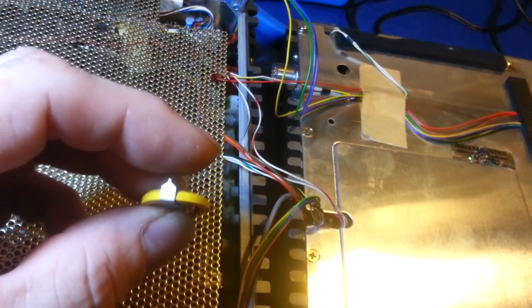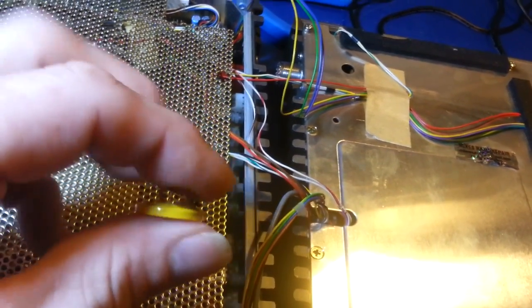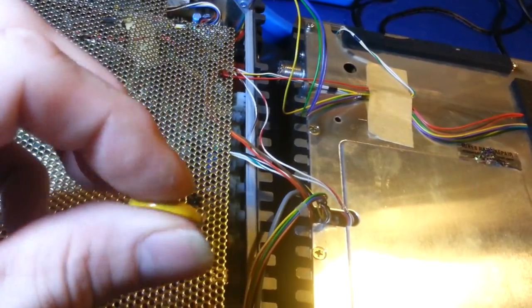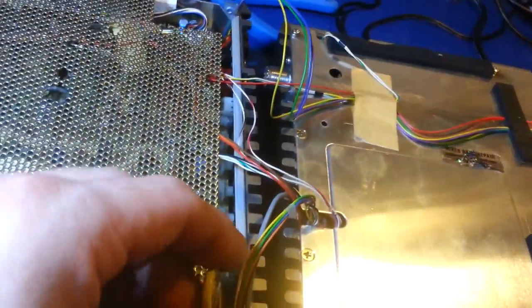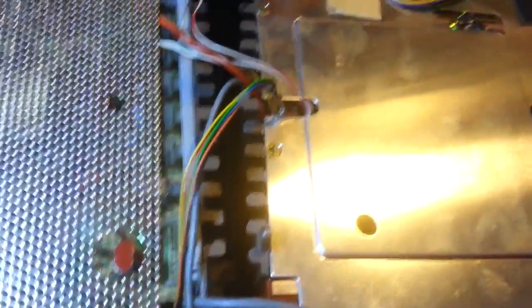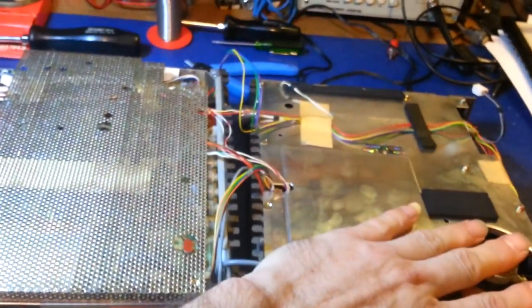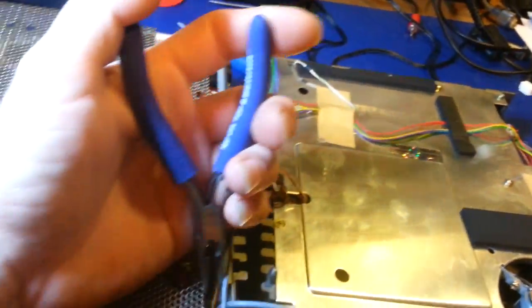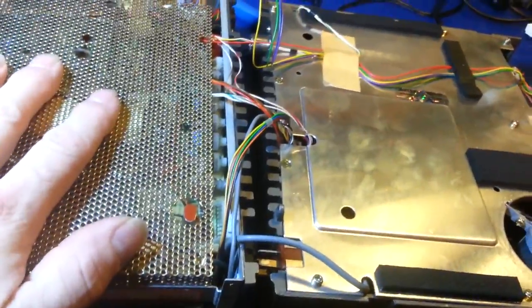And you can just then solder your wires onto that, fold these tabs so they don't short out, and so it's a lot thinner, but fold them, slide this into a piece of heat shrink tubing, and then you can just tuck this down inside there, because there's plenty of room here, right down in here, to tuck that battery. Then the next time around when you need to replace your battery, you can just fold your PA filter unit back, reach down in there and pull that battery up, and it's right there. It's easy to service. You don't even need to take this cover off anymore.